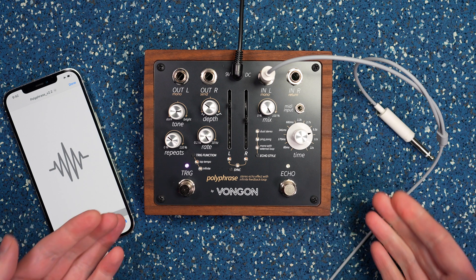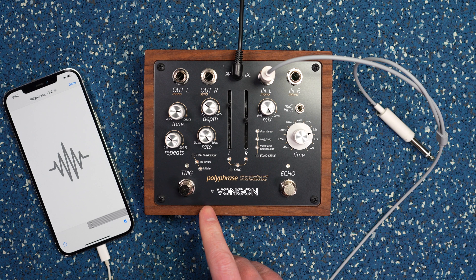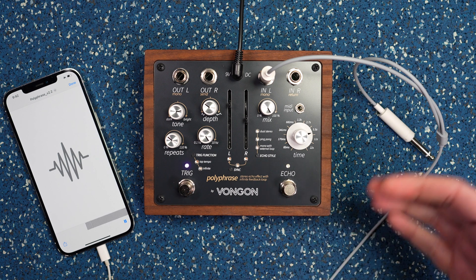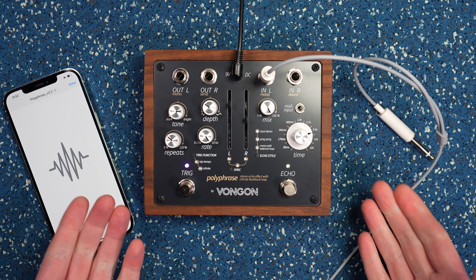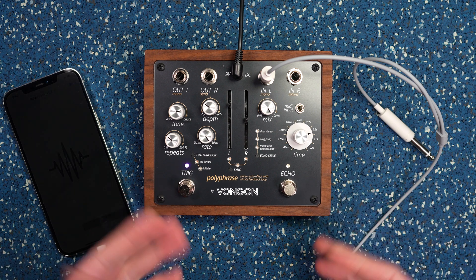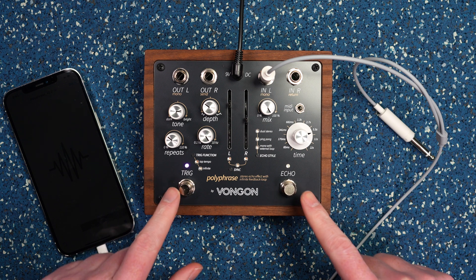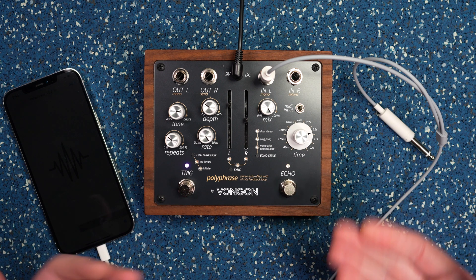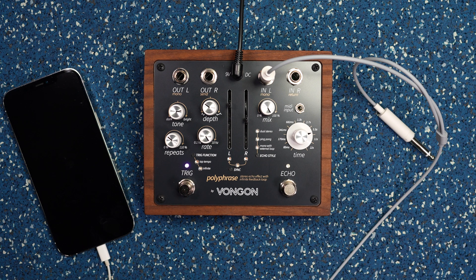You'll see that the process is working properly because the left trig light will flash rapidly, and then the echo light will flash on occasion, maybe every five to ten seconds or so. If for some reason that isn't the case, there's an error of some kind — you'll be alerted to that because the trig and echo lights will both flash rapidly, and it won't have the pattern where trig is fast and echo is occasional.